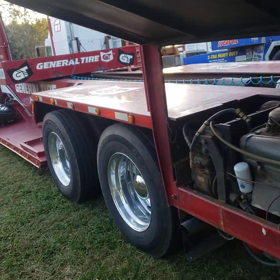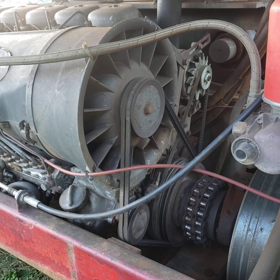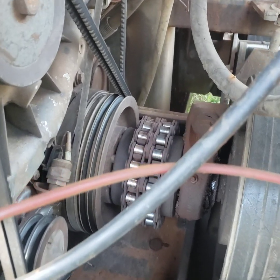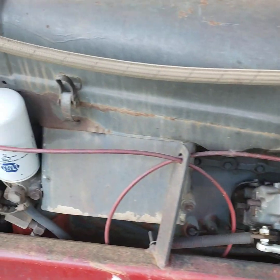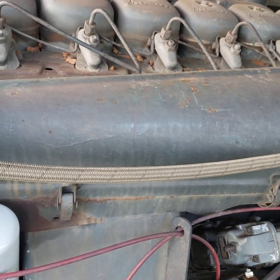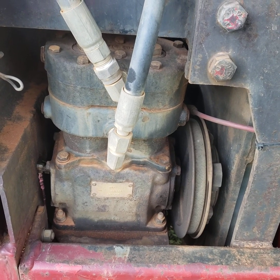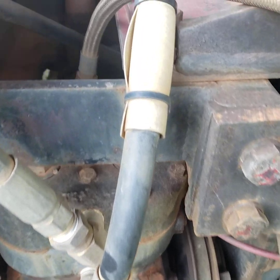Now the engine's actually in here backwards — there's the front of the sled, and this is actually the front of the engine. There's the cooling fan and the drive belts for it. The engine is actually beside the transmission that's over underneath the middle of the frame rails, so in order for everything to turn the right direction for rotation, you can see the harmonic balancer there is coupled up to a double roller chain connector, connects to our big drive belt there. That's the engine oil cooler; there's a transmission oil cooler inside the air tunnel there. The flywheel end of the engine here has a pulley bolted to it, and there's our double piston air compressor — it's actually a liquid cool compressor, but is cooled by the transmission fluid itself. There's no water or liquid to circulate through it, so we use the transmission oil.